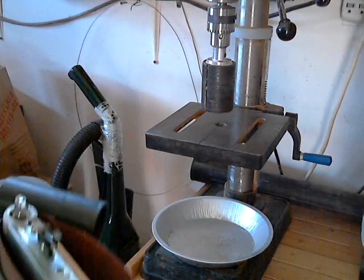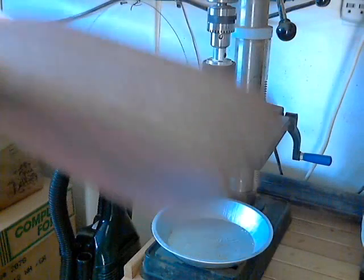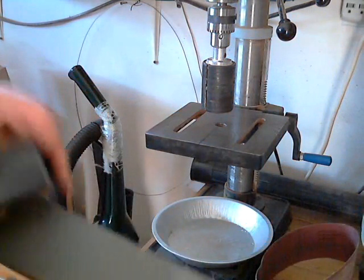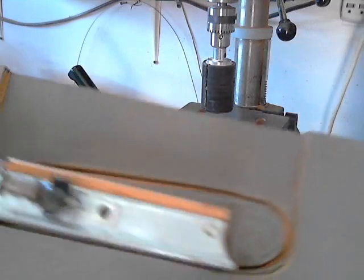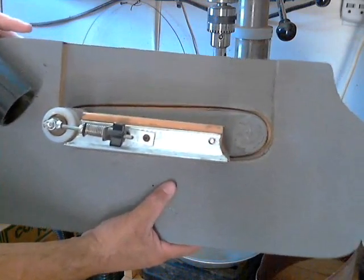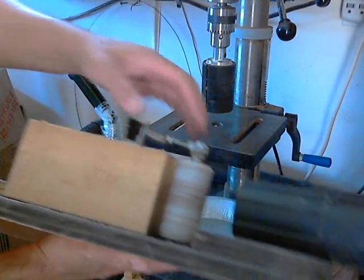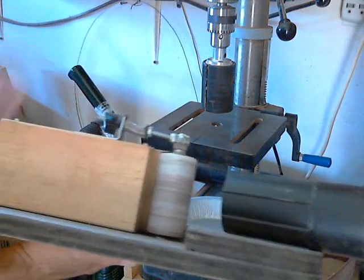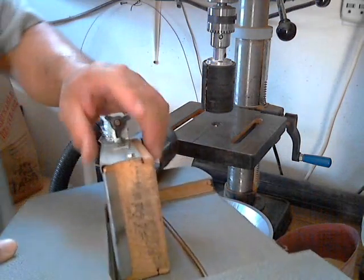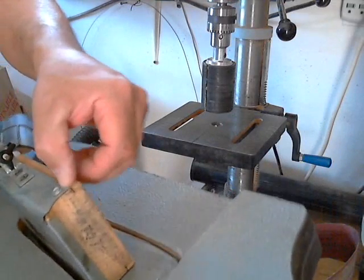Let me see if this gets on here right. This is the jig, the body of the jig. This is just a regular piece of sandpaper belt that is the same size as my regular belt sander. It's pretty good size, probably about 20 inches long or so. It's a wooden 2x4 here. It's got a Teflon roller, and on the middle of that I have some brass bushings I'll show you. But over that wooden 2x4 is a metal 2x4 and it's screwed down.